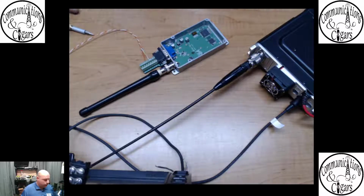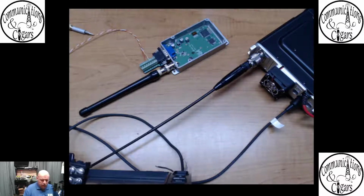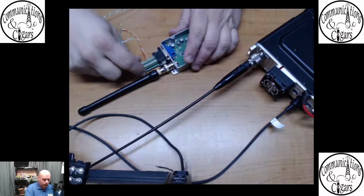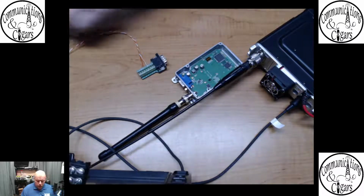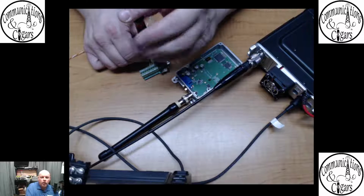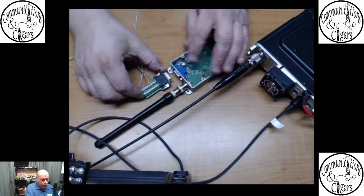I always like to do a quick test. What this quick test basically does is it says, hey, do I have transmittability? So pin number 3 is going to be my PTT pin. Now, because I'm hooking up cables, I always suggest disconnecting or powering off your stuff while you're doing that. The reason being is because guess what? It's never going to fail. You're going to accidentally touch a wire, short something out, and zip, zap, boop. Your expensive project that you're working on has now just become a ghost. Okay, you have decided to let the spirits out.